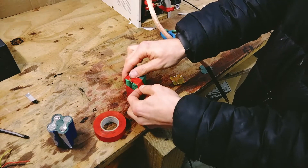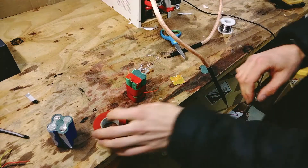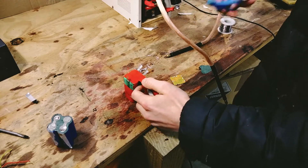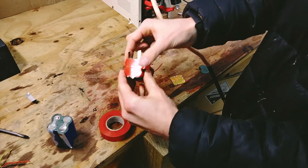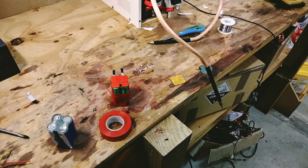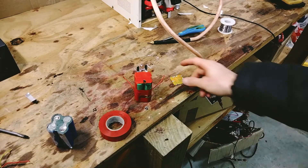Tape will help a lot, especially some good quality silicone tape. You know what's even better though? Kapton tape — it's a transparent or translucent orange tape that's designed for high temperature applications. I wish I had some right now because that would really help. As long as you press it on well the first time it'll stick, but if you leave it out it collects dust and then it does nothing. Our battery looks like a little android guy and we're ready to put the BMS on.